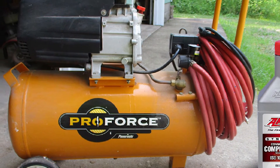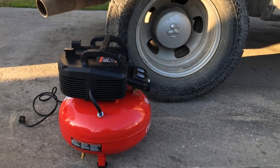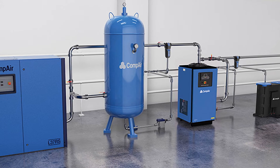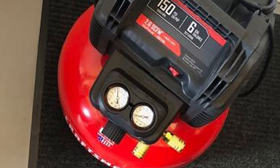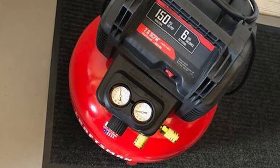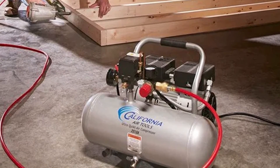The real advantage to using an oil-free air compressor is lower maintenance and improved portability. This makes an oil-free air compressor a good option for contractors who regularly transport their equipment from one job site to another. For a home shop that doesn't require exceptionally large volumes of compressed air, an oil-free air compressor can be a good choice. Operating environment can also be a deciding factor, as oil-free air compressors rely heavily on air cooling — meaning that in a hot climate, oil lubrication would be more beneficial.